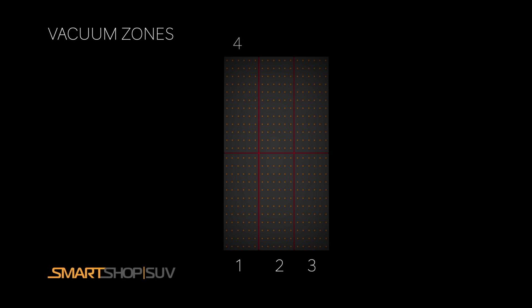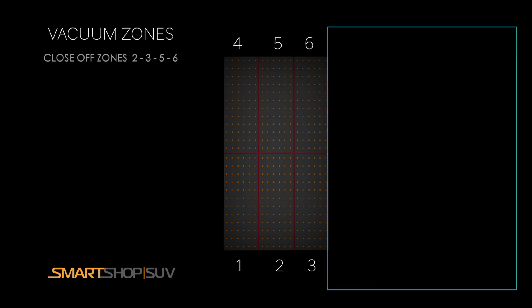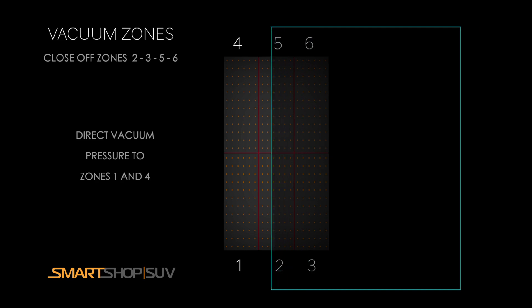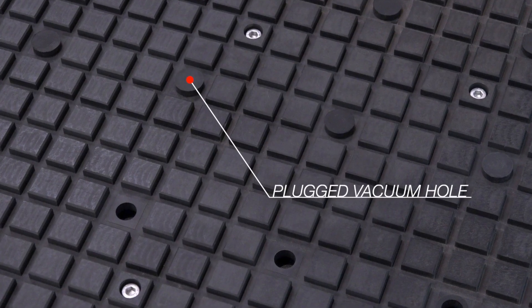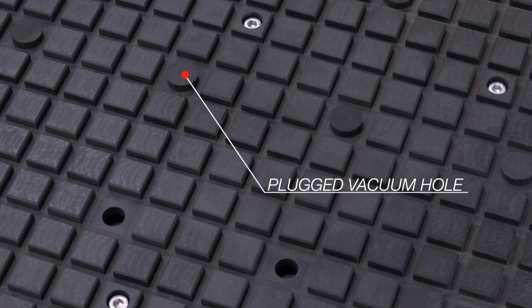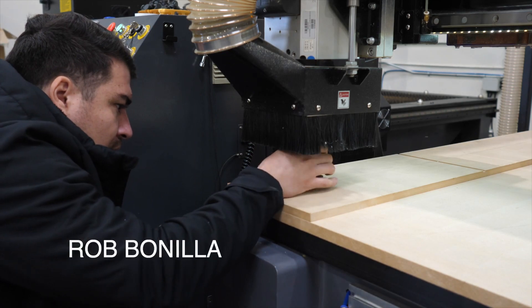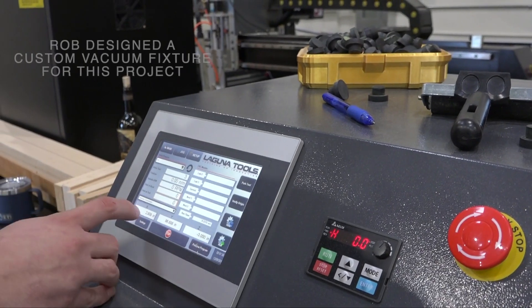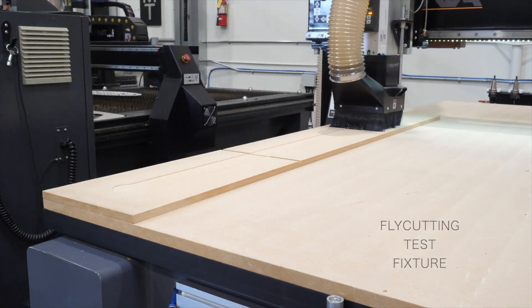On the Smart Shop SUV we have six vacuum zones, and what we're going to do here is block off zones two, three, five, and six, and direct all of our vacuum pressure to zones one and four. Then we'll use some plugs to block some holes either on the top part of the vacuum fixture or the bottom. Rob designed a custom vacuum fixture for this project.